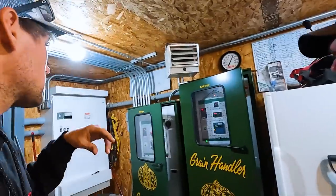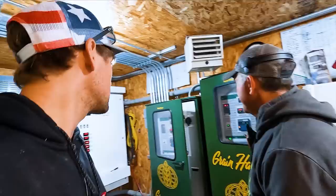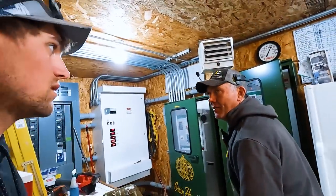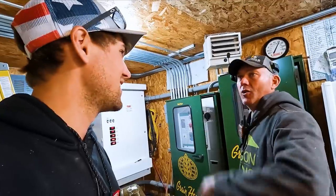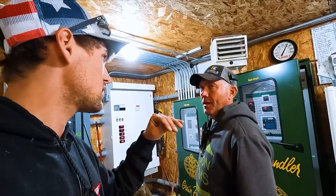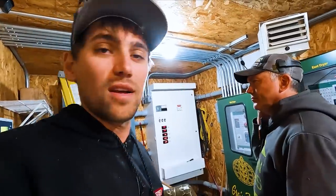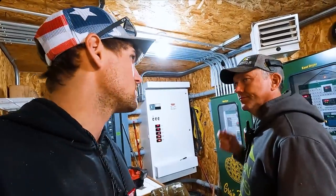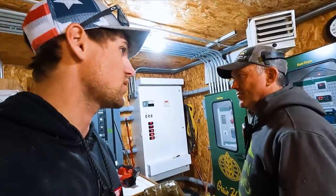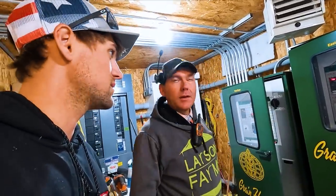I'll be shutting this one dryer off because that's broke already. Gas valve problem. Yeah, don't you shut that off. But it is lowering temperature. You need to turn it up some. I'll wait for the sparrow to sit on that arm and wide open gas. The gas valve automation is not working. That is not a part of the new system that adjusts the temperature. That's not working. Don't think it was working when we finished the season and then we forgot to fix it. So that's on us. Although we did have it inspected. They missed it. Yeah, I don't know.